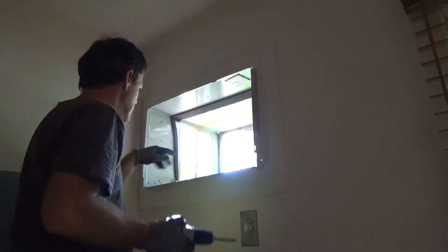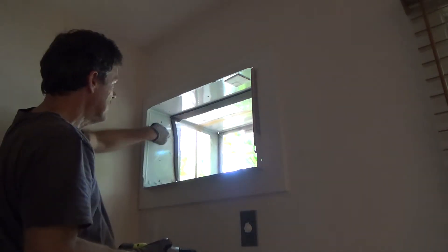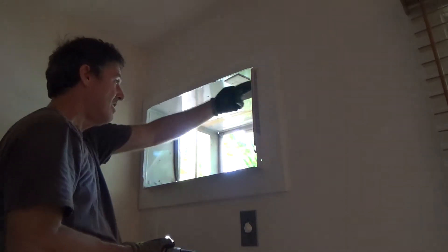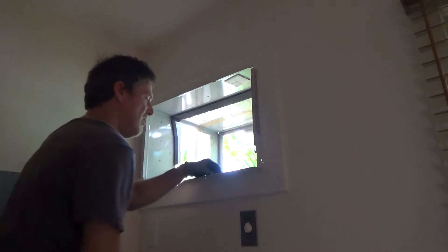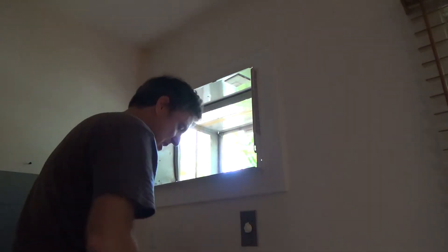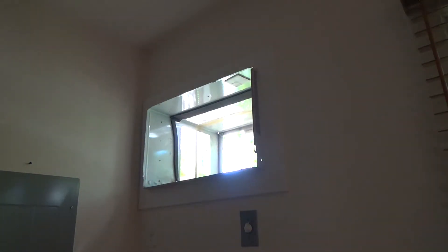I like to put two screws here — there's four holes here, four over here, three up here. I usually do the top and bottom one on both sides and one up in the middle when I get ready to install it. I use sheetrock screws — these happen to be galvanized inch-and-five-eighths sheetrock screws. You can use regular black sheetrock screws, but if you do, just know that eventually they're probably going to rust out.